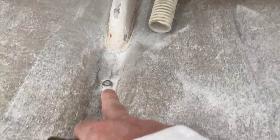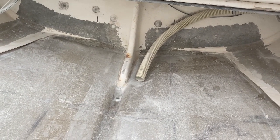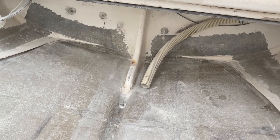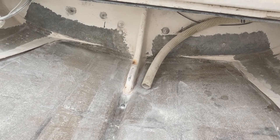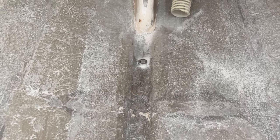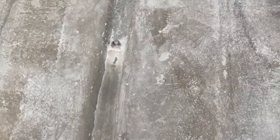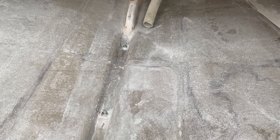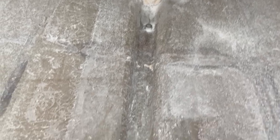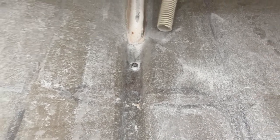I just want that to do. I had a look at this knee in the back — there was all glass lifting around that bolt and nut there, got all the way through the hole because they're filled full of wood underneath, because on these Orkneys they're cut away. Well, that ain't good for beach launch and trailers because they'll get to one or two foot on the trailer, drop down and hit the engine and the stern end of the boat on the trailer, so we always put it in full of wood. Obviously that's all glassed over the lot. So I got in with the little sander and ground all that out all the way along — it looked like there'd been a few bits of repair work. My old chap will have placed that bit of wood underneath there because when the boat came back it was crap, so it must have had a dodgy shady glass layer put on it. But then again I reckon the glass was wet when they did it.